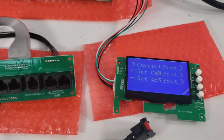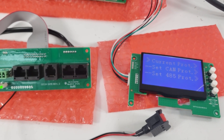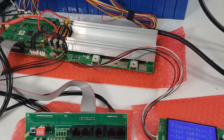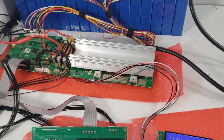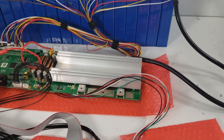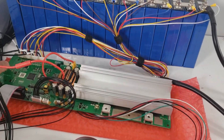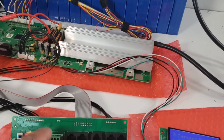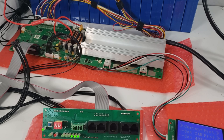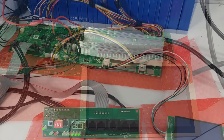While we're doing all this, maybe we'll show you what we've been working on with our 48V setups and when we're going to make those available. But this was just to show you the process to set up the Pace 16S BMS. Take your time — it's no different than setting up a four-cell battery except you've got 16 cells. Some people had questions on how to turn it on or off, and that was because they were plugging the switch in the wrong place — on this model you have to plug it into the breakout board.